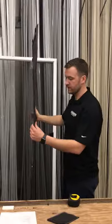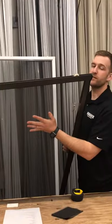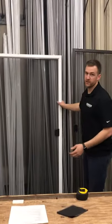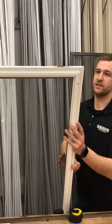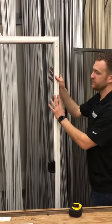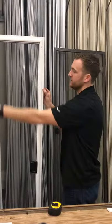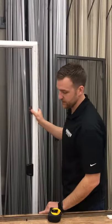The standard door on this one is the half inch all the way around, and this is retrofitted with the vinyl wheels that come standard to all of our doors. You can upgrade to steel wheels, which is what the 1350 door has — you can see the steel wheels in there. The difference between the 600 and the 1350 is the 1350 has an extra extruded aluminum around the inside to create a stiffer door. Still the half inch thickness, but on the inside of the frame it's just that much thicker aluminum to help keep the stiffness of the door.